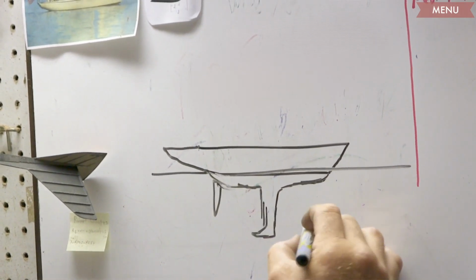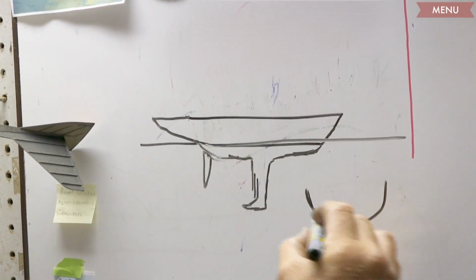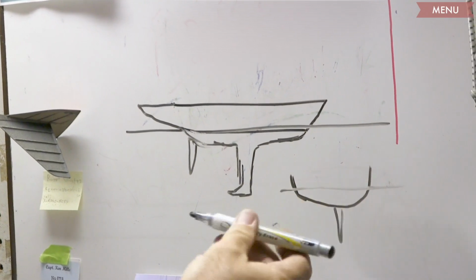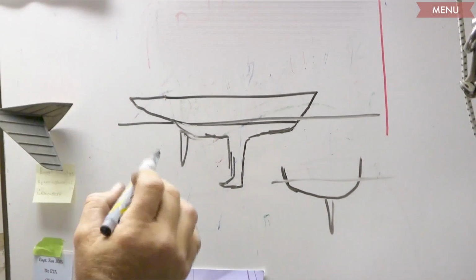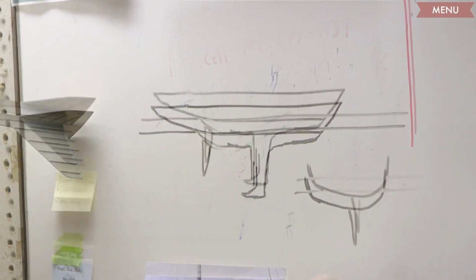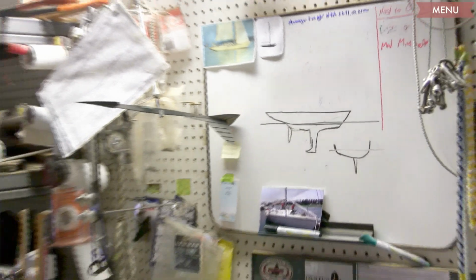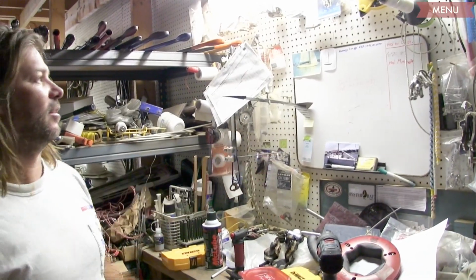So its underbody is the more modern canoe style with the fin, so very low wetted surface, much more form stability, and of course coring the hull and everything makes it much lighter, so it's much more nimble for just sailing off the mooring and sailing around in light air. And Maine and New England in the summer typically are light air. By coring the hull, you can shed a lot of that weight. You don't have all the bulk. You only need 5 knots of wind, and you're clipping along.